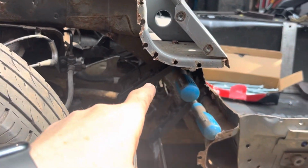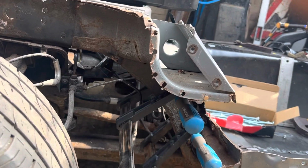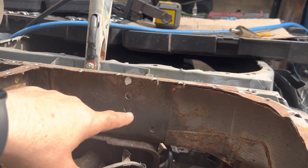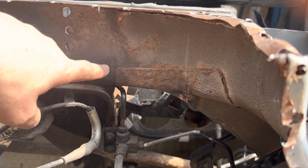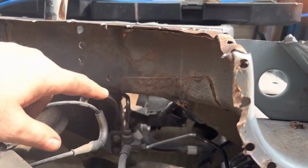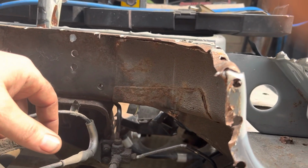So what I'll do now, I'll get these clamps off. There's a few holes I need to fill in as well, I think somewhere, might be on the other side, but they could be done right at the very end, and then obviously that's the chassis rail there, so we can tack that in as well. Once all the wheels are off, them two holes there can be tacked in as well. That bolt I'm going to leave, because that's where I think the ABS bolts onto, but we can add things in anyway. And obviously, with it being a box section now, I can drill and tap it, but I also want to drill a few holes through it and put bungs in so I can wax oil the inside as well.